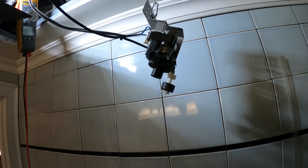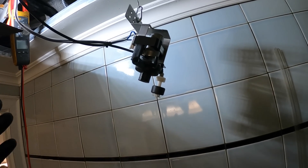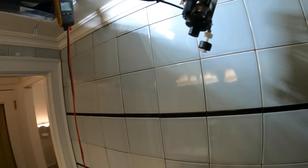The little nut on the float was so brittle — I literally touched it and it cracked off. So it's just a matter of time before this was done. Maybe you could find another nut for it, but I would replace the pump, clear the drain, and change the condensate pan. That should do it.